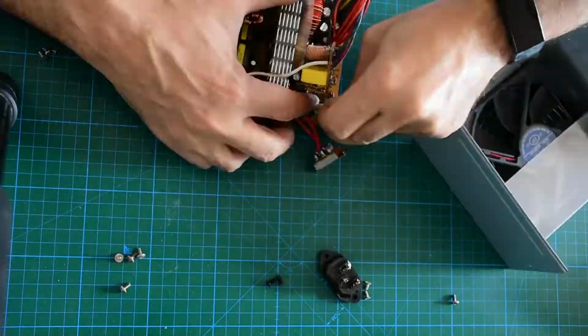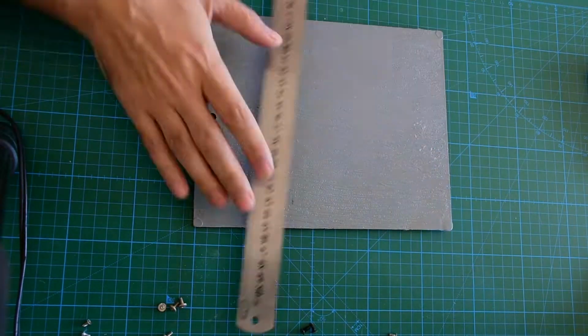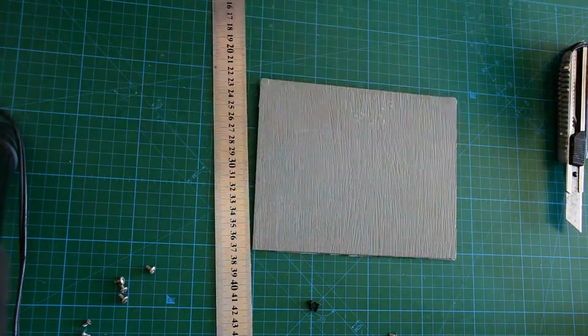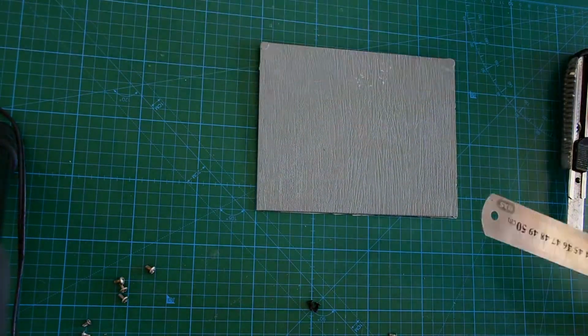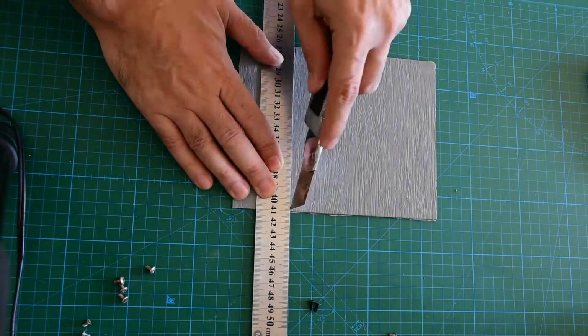It will have input for probes, input for wires, a digital volt-ampere meter, 2 potentiometers as coarse and fine adjustment, a heat-sensitive fan and an overheating warning LED. Not the best, but a little bigger.